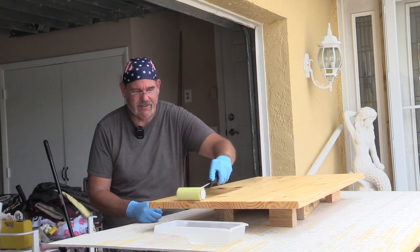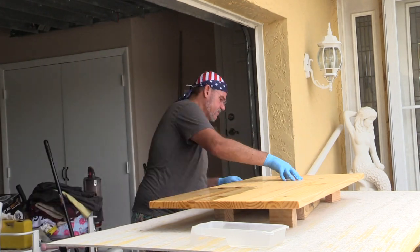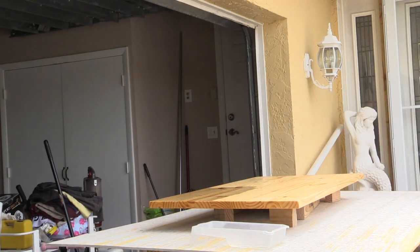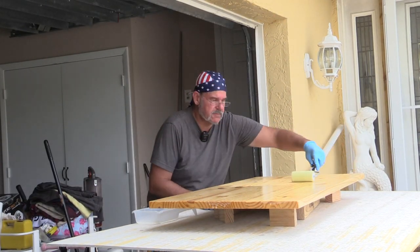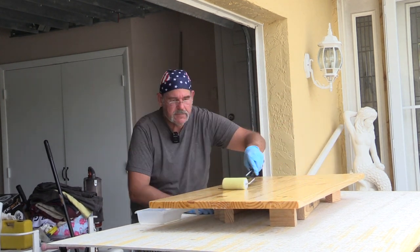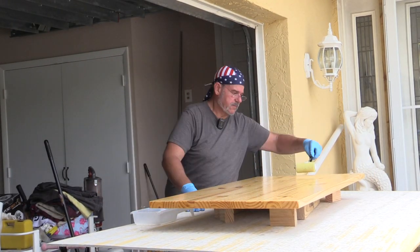It's now just a matter of applying the epoxy, much like we did the first time. The difference here is we're using this very, very thin foam roller. I won't bore you with all of this, but I went through and did the roller on the bottom, 4 inches of each side, the sides as well as the top. I then used that small cut piece of the roller to rub the whole thing down. I waited one day, took a light sanding of 220, and I applied a third coat after that, and it looks phenomenal.